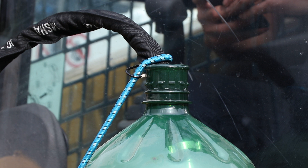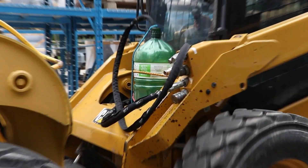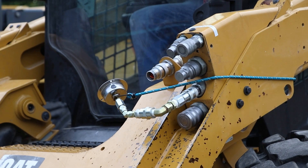Make sure to tie the hose as well in case there is high pressure. Do the test at a solid barrier but be sure that the barrier is strong enough to hold the full force of the skid steer. If you would prefer a different testing method, we also have a video explaining how to test the back pressure with a pressure gauge, which is a more accurate way of testing.